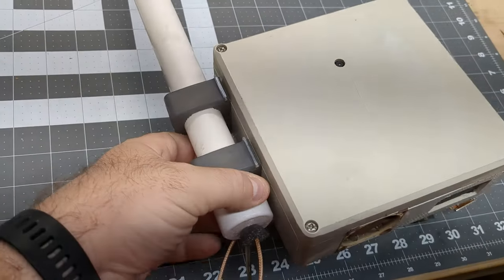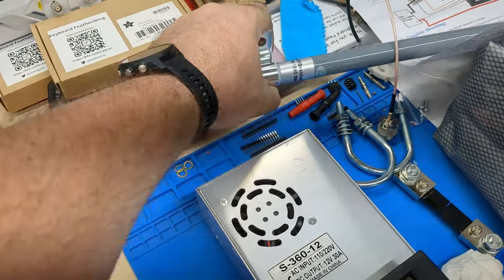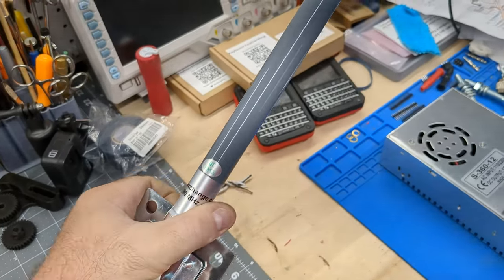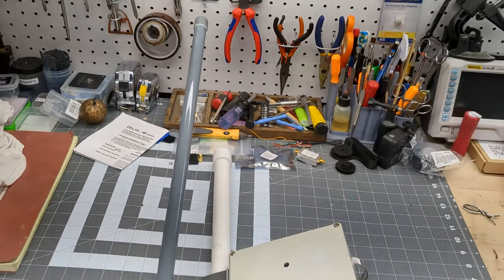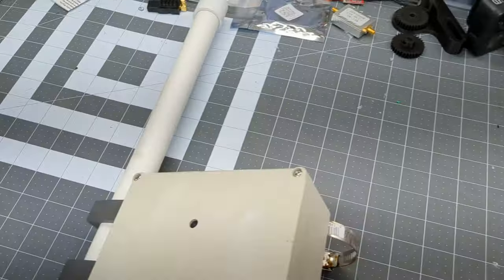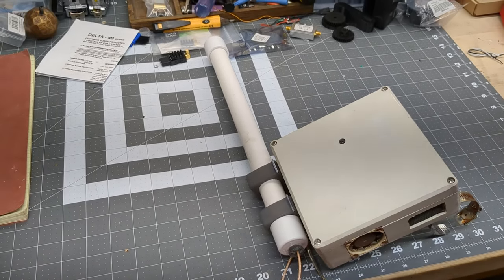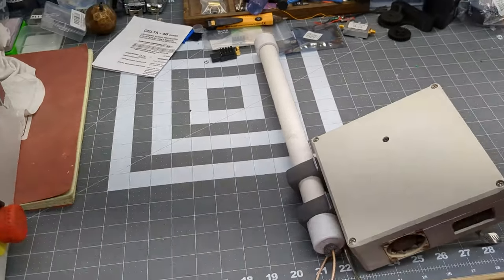The main reason for doing all this is to replace this homemade J-pole with dedicated ADS-B exchange 978 and 1090 MHz antennas. I'm hoping to see a signal improvement, since this J-pole was whipped up from scrap and never had any SWR check or tuning — I just lacked the equipment and was frankly too lazy at the time.